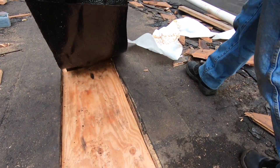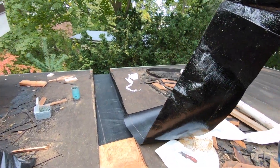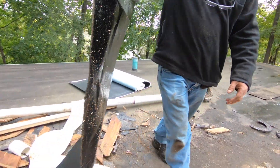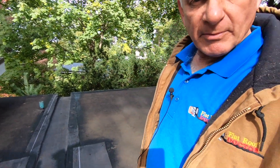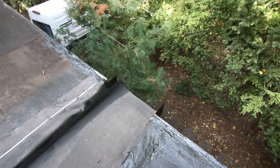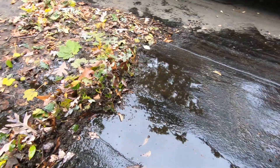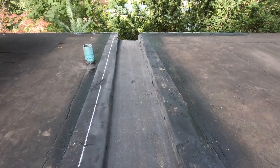Cleats are in and now I'm putting a base liner in. This is my liner — it's a peel-and-stick liner and we put that in. We cut it into shape, got the channel done, got the membrane — torch-on after we did the liner — and that's what it looks like. It's going to be a Niagara Falls once it rains tonight, but it looks good. This will now wash down easier and will not clog up — this drain will always work.